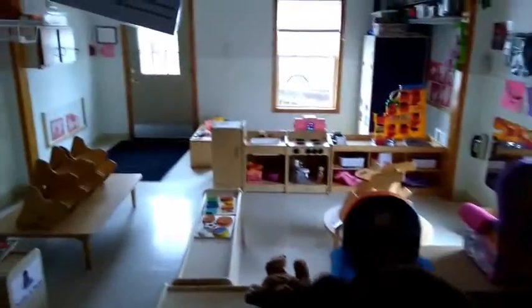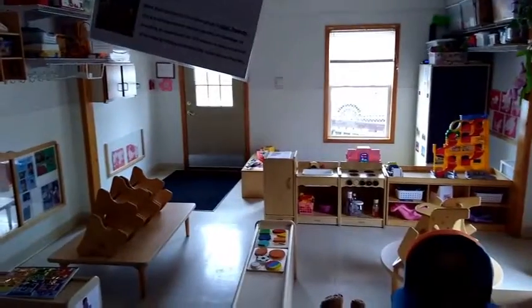I'm out of the daycare here, obviously. I'm going to draw things out — a rough sketch of the building, or this half of the building, and do a little load calculation. So what I have to do is measure the walls, get all the window measurements, write down what they are, write down the doors and stuff like that. I'm going to draw this out on here and go room by room, then put them all together when I'm done.